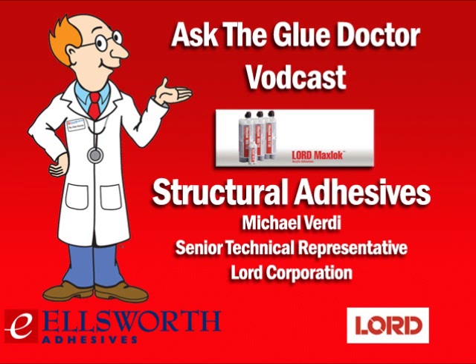The goal with the development of MaxLock was simply to provide a single adhesive for bonding multiple substrates for use in many different stringent environments. Can you tell me if there are specific circumstances where using structural adhesives for metal bonding may not be advantageous? Yes, there are certain joint designs that are not conducive to the utilization of a structural adhesive. One prime example would be a butt joint, which does not lend itself well to being bonded. We actually recommend that customers design joints that will see shear or compressive type loading while really trying to avoid any type of peel or high tensile loading. In some instances, a customer will utilize strategically placed welds or mechanical fasteners to avoid peel and tensile load while using our adhesive throughout the remaining part of the bonded area.